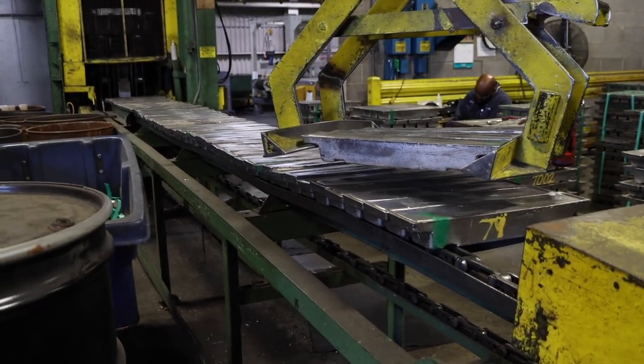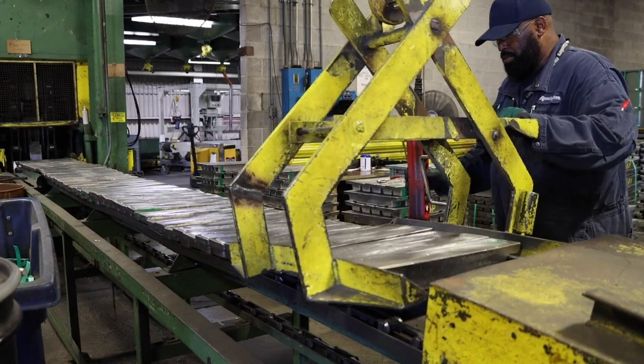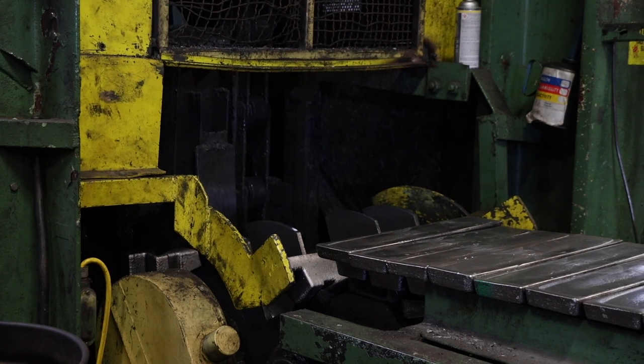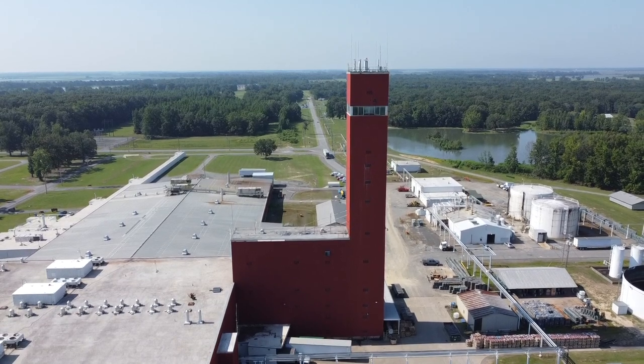Our lead is brought in as 60-pound ingots. We load them on an elevator and they go up a chain conveyor all the way to the top of the 11th floor, into a big pot that is extremely hot and melts the lead into liquid. Once it comes out, it goes through a tube and feeds over the top of a screen. That screen has holes for particular sizes — the smaller the hole, the smaller the shot; the larger the hole, the larger the shot. We allow the shot to drop just like raindrops, and it forms just like a raindrop — getting very round as it falls, hits water, and cools.